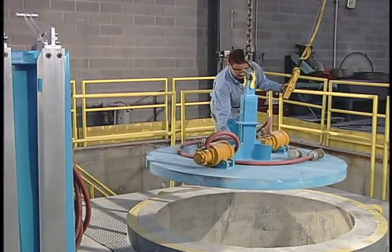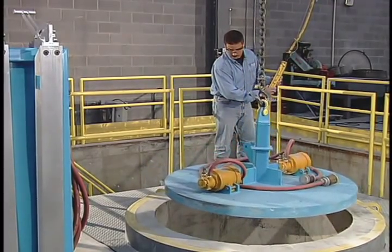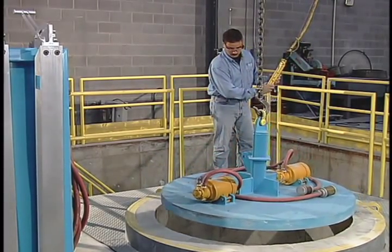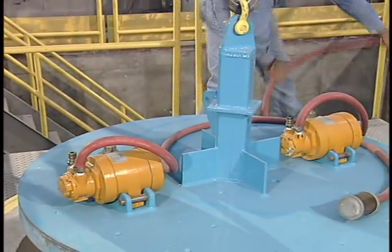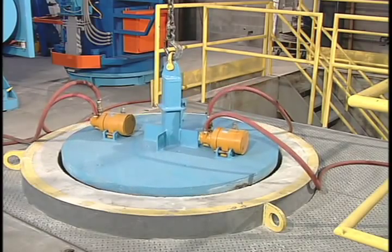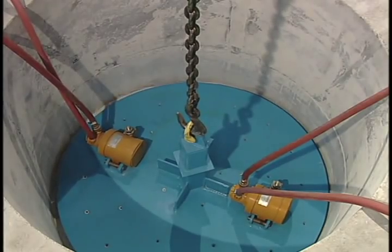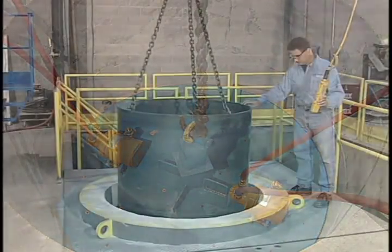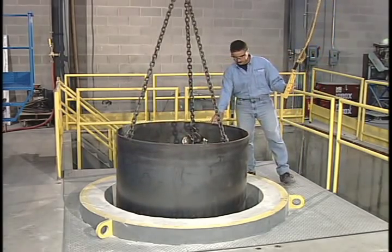Step number one of Gradmatic's system involves compacting the entire furnace bottom in one operation from the furnace deck, using a vibrator plate equipped with eccentric pneumatic vibrators. No worker enters the confined space of the furnace to vibrate the material, providing a greater level of protection from hazardous dust. The entire floor is compacted in 10 to 12 minutes, depending on the size of the furnace.